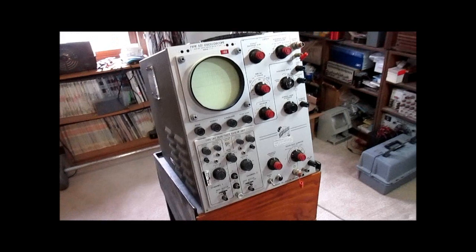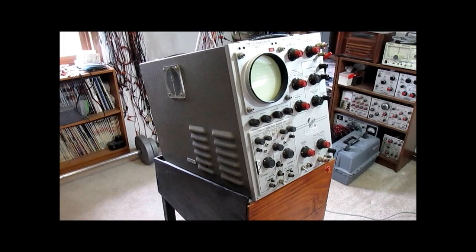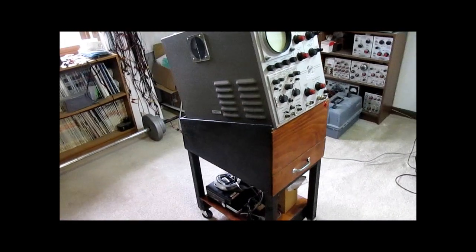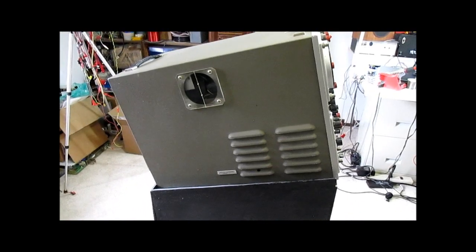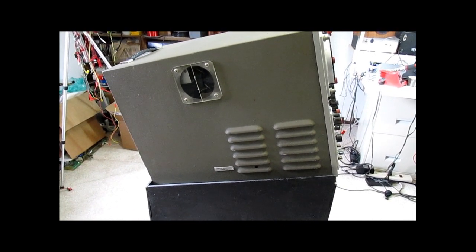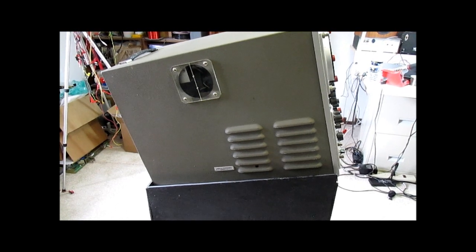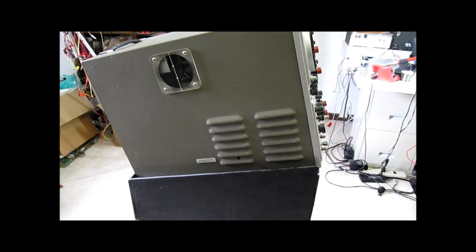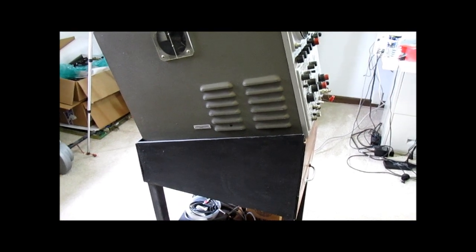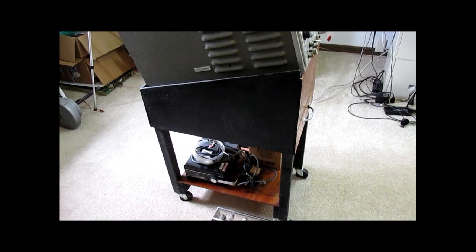The scope was in working order the last time I had it powered up about a year ago. It's also in what they call the brown era, and I have it on a homemade cart I made many years ago. I've had this scope since 1986, and I believe I paid about $5 for it in non-working condition. Over the years I've done a number of repairs and recaps on it, and I think the only original capacitors left are the filter electrolytics — surprisingly enough. Those seem to have been perfectly fine. It's always been the oil and paper capacitors that end up getting leaky and failing.